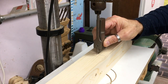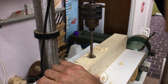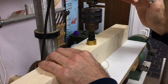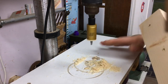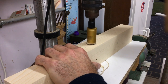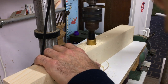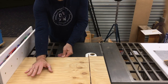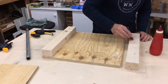Next it was time to start making the top, which was basically three lengths of close enough to 2x4s sandwiched between two sheets of ply. The 2x4s needed a 26mm hole drilled in the centre for the pivot axle to pass through, which was steel water pipe — but the only hole saw I had was a 28mm so that had to do. This process is pretty self-explanatory: just glued and nailed together.